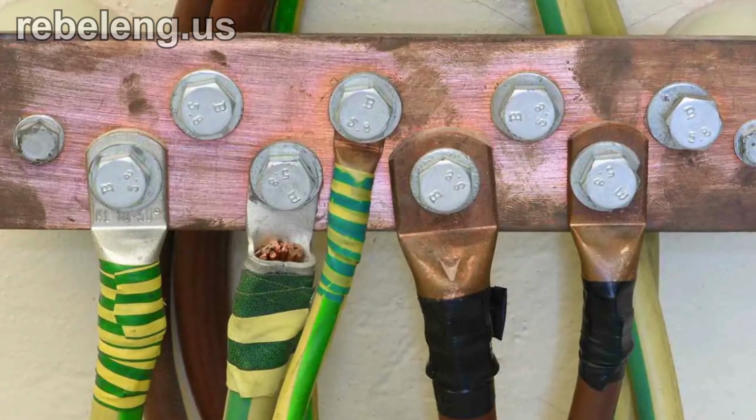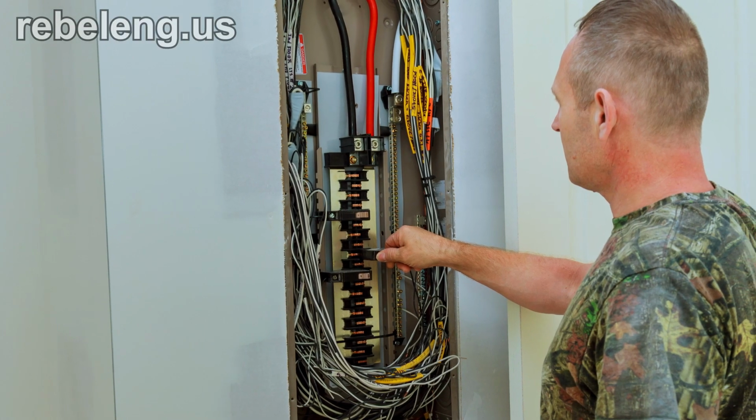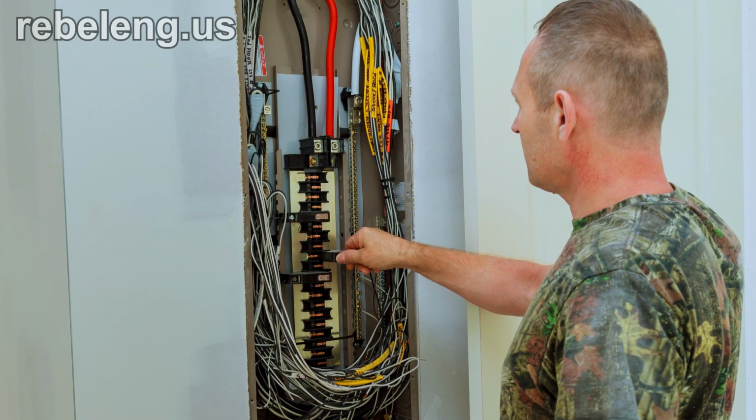On CNC machines, there had to be careful grounding as well as electrical isolation to prevent the CNC controller from damage caused by the high frequency and the electrical noise emission. Higher-end industrial plasma units still use high frequency, but these are dedicated systems that are properly shielded and grounded for the application. If you're spending $50,000 on a plasma cutter, you can assume they have the system figured out.